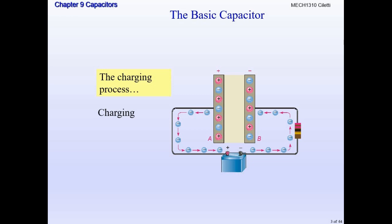In your car stereo, if you have a lot of amplifiers really booming the sound, and you don't have a capacitor, then when you hit that low bass sound, it drains your battery. If you're driving at night, your car lights will dim and then come back on, based on the sound. What you do is use a capacitor to smooth that out. Instead of drawing from the battery, the amplifier can draw from the capacitor for those low bass signals so the battery doesn't drain. If you have a large enough capacitor, like a 10 farad capacitor, it takes a lot longer for it to drain, so your battery doesn't get hit every time a big bass note hits.